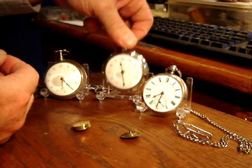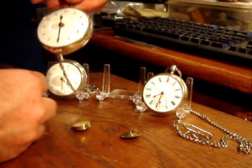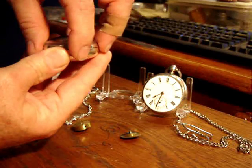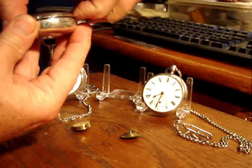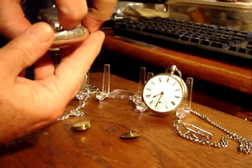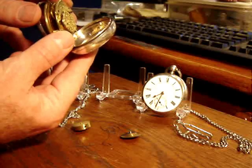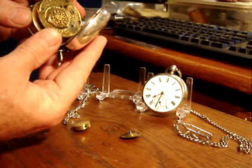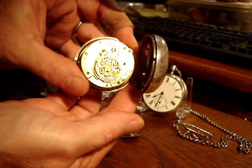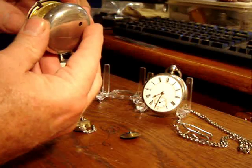The second one is very similar to that first one — again, an English Fusee, Verge Fusee, pair case. When I obtained this watch, it did not have a chain inside and the crystal was missing. So I found a high dome crystal, as you can see here, installed it on the watch, and was able to install the chain. This one runs fairly well, though it tends to stop and runs a little fast. I think the hairspring is a little too strong for it. A very nice example of a Verge Fusee type watch, made around 1804 to 1805.